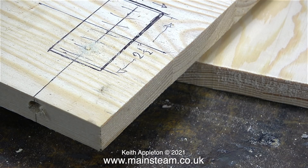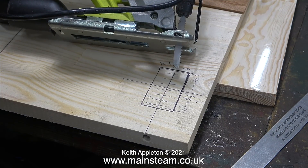You can clearly see that the hole is not in the middle of the main wooden baseboard. Why did I drill one size up from 5/16ths? I don't want my 5/16th pipe to be a tight fit - I need a bit of clearance because this pipe, which will be buried in the baseboard, will get warm when the steam plant is in use and expand.